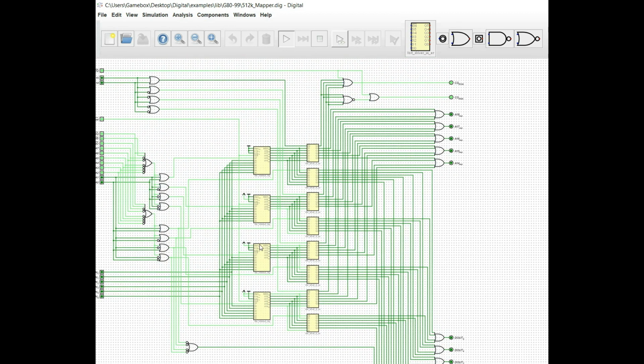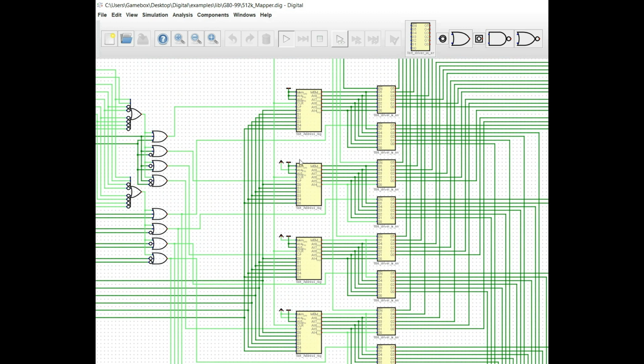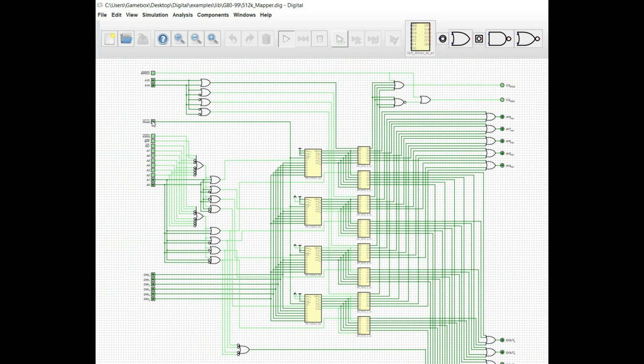So the first thing of note is when we design these registers, we designed them so that they could be preset upon startup. And of course, if we reset the system and we are looking at, for example, the very bottom window in memory, we can see that as we wanted, this actually is A14, A15, 16, 17, 18. They are all at a state of 0.